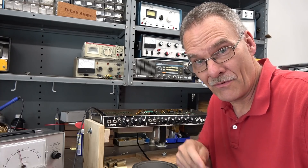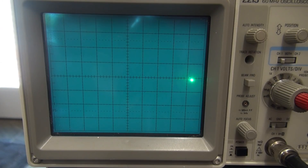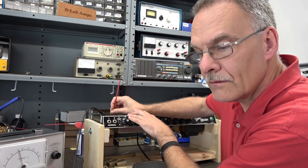We've got two video cameras going — one watching me, one watching my oscilloscope. If you take a look at the scope, you'll see the little dot going across, which should just be smooth because there's no signal applied. But watch the dot — see a little oscillation? The other night I was watching this and I had five to seven pulses and then it would stop, then another five to seven and it would stop. It was almost timed, very strange. So that's when I got the idea to monitor right on this coupling cap as I tap. Watch the scope when I'm hitting this cap — see that sensitivity? See how I really made her jump? Just rocking that cap around, it's causing all kinds of fun on the oscilloscope.